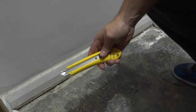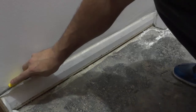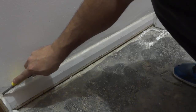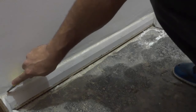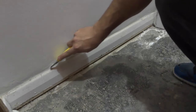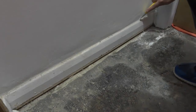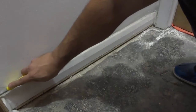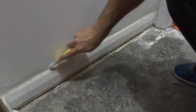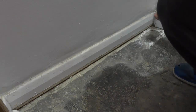So just get a utility knife, and what you're going to do is just take it and run it along the edge of the baseboard or of the trim. So just take it like that — I'm just going to bring it a little bit shorter — and you're going to run it along the corner of where the piece of trim meets the wall, just like that. Now you're going to do this a few times, you're going to need to do it more than once, just continue to run it along that corner of where the piece of trim meets the wall.